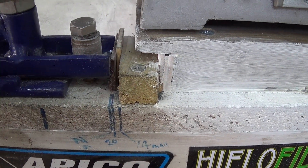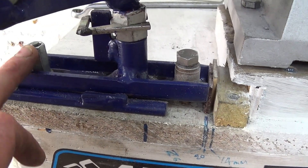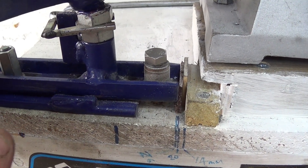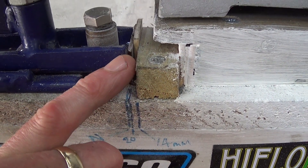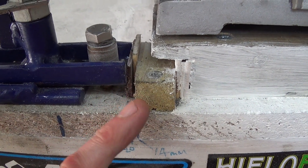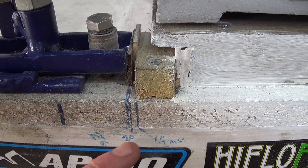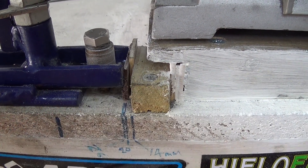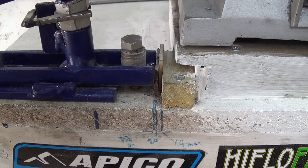You can see that this base is on a slider. I undo this one, and it's spring-loaded, so I push it forward. When I'm cutting a 14mm drill, this face comes up against this piece of wood here. As I'm cutting larger drills, you can see I've marked 20 and 26, and it moves back a bit — but it doesn't have to move back very far. That was one of the things that really surprised me; I imagined there would have to be more travel.